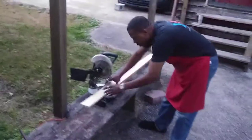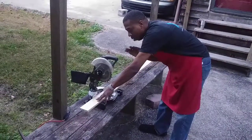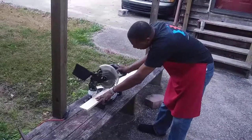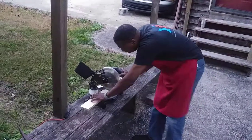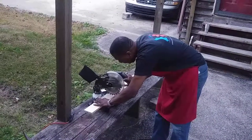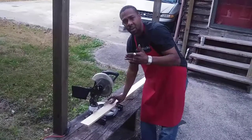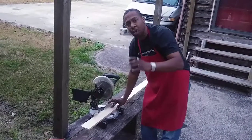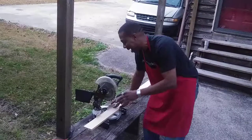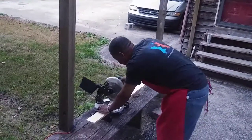The way I laid this out, I'm going to cut the line completely out. When I set my miter saw down, I want my saw blade to take the line out completely. Some people will tell you to cut on the left side or the right side, but I want to use all of my boards, so I'm going to cut the line completely out. Here we go, let's get started — this is going to move fast.